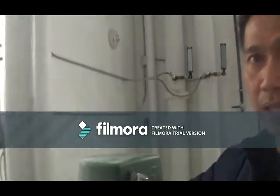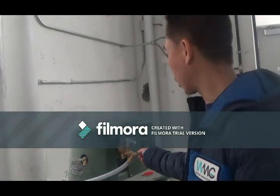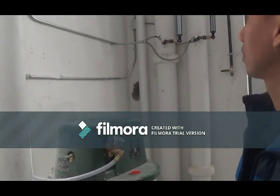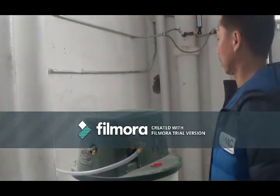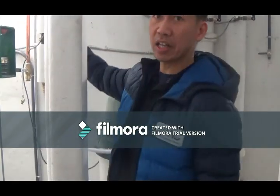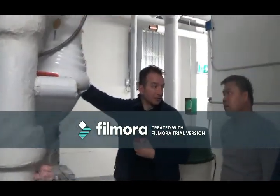The pressure here is normally at 30 PSI. If that goes below that, this glycol will automatically feed up the system. Why is it closed? It's currently unplugged now. We've got to make sure that the glycol strength is good.